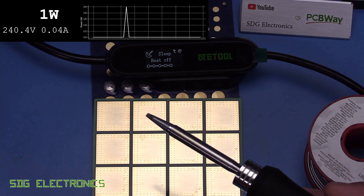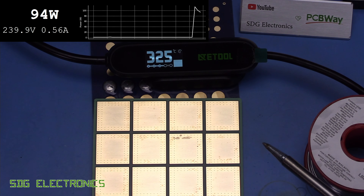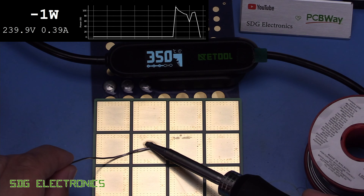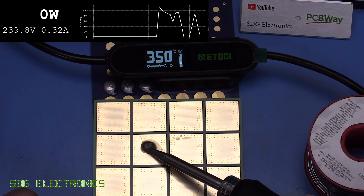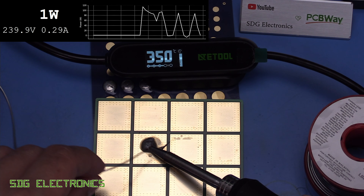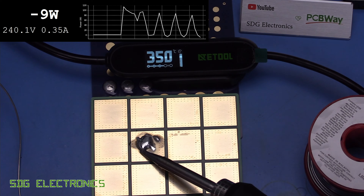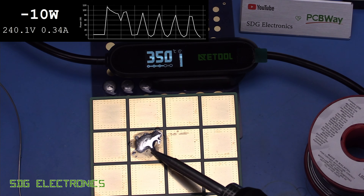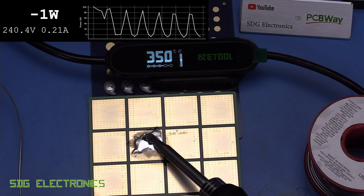Let's see how we get on with the largest tip available, heating it up now with a slightly higher thermal demand PCB. The graph shows we're easily capable of putting 85 or more watts into the soldering tip — the question is whether we can actually get the heat out from the tip; we might be limited by the geometry. There's certainly no problem with the capability of the heater in the cartridge, but I'm not sure where the thermocouple placement is, or how conductive the tip is to get the heat out, because the solder is dragging just a little as I move around this high thermal demand PCB — it's got four layers all tied together with thermal vias. We don't get quite as good behaviour compared to the JBC or Metcal stations; the average is about 45 watts.